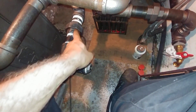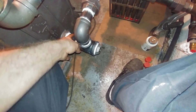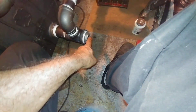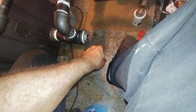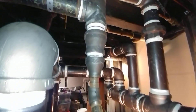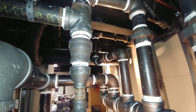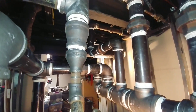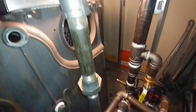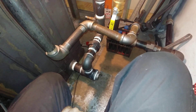The equalizer line then heads back to this tee here. This could be a bushing down, but we go in with two inch for a little more corrosion resistance. This is an extra heavy two-inch nipple on a tee with a galvanized bushing, and this is where we can put our drain. This is the drip from that counter-flow main we discussed in another video — rather than have the condensate return go into the header and interfere with steam flow going out, we have it dripped out and returned back to the boiler.